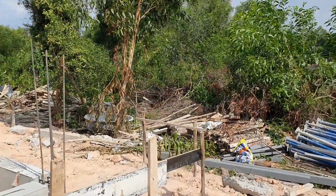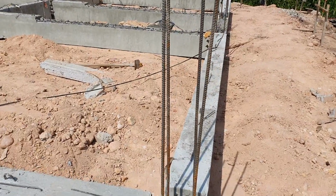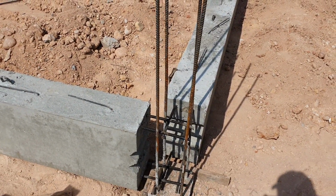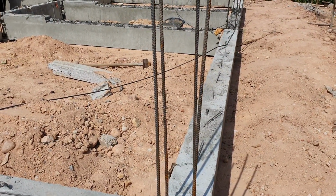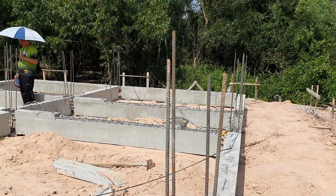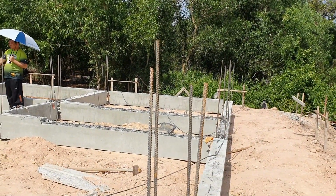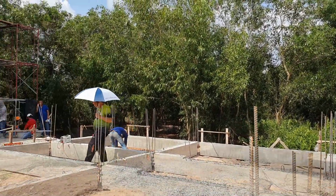When it's all settled, I'll get the levels right on the concrete beams, get the horizontal levels. Those rebars there have already been welded. They'll get their heights, set them, and then they'll box up around them. I'll get the concrete mixer in and pour that. I'll wait until I get enough work to take a load of cement, and then they'll pour all those.